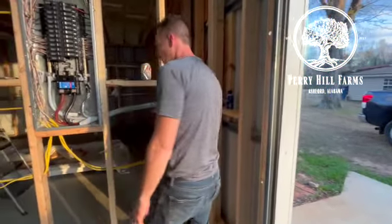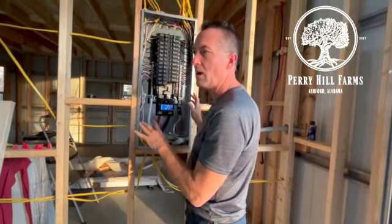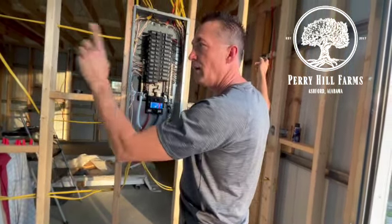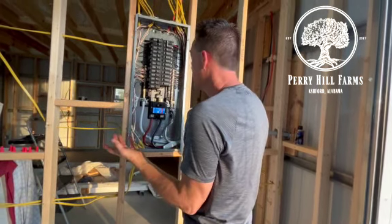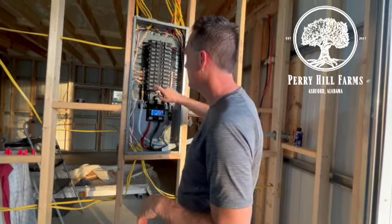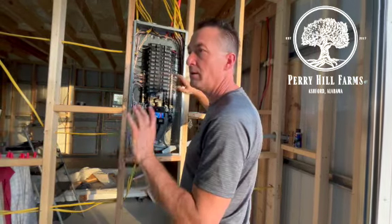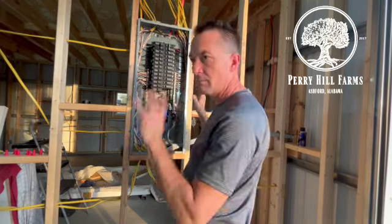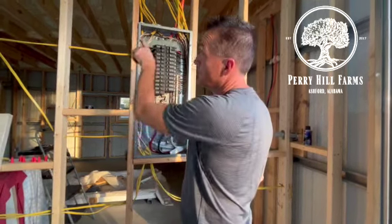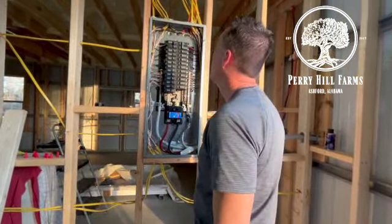We ran that in through this conduit and hooked it to the panel. All the breakers are off right now. Once we get power, we'll turn on the main breaker, check the first three wires for the stove and the two wires for the air, and make sure everything's running okay. Then we'll flip this on and start testing one breaker at a time — we've got them labeled. We'll test it, make sure we have power, each one coming on properly, then turn off anything that's bare wire or not hooked up. After that I'll be able to put the panel cover on and start hanging sheetrock.